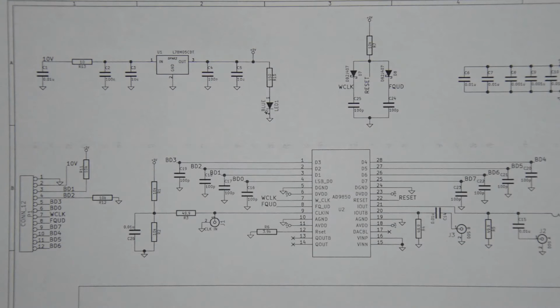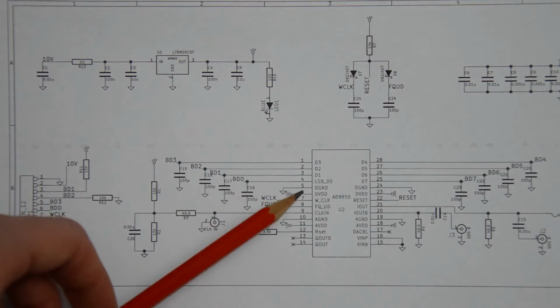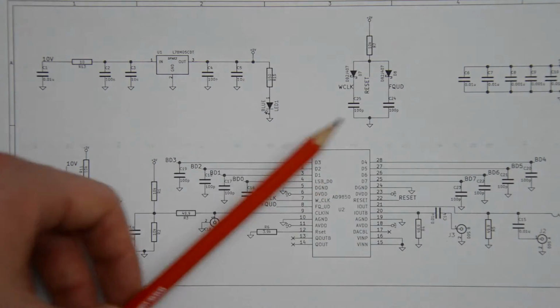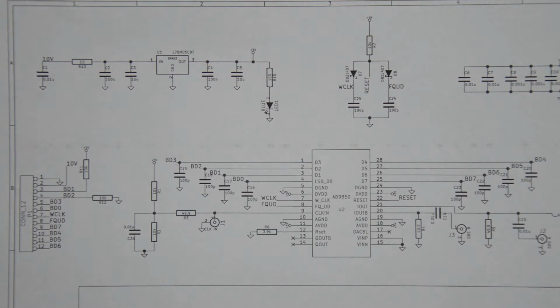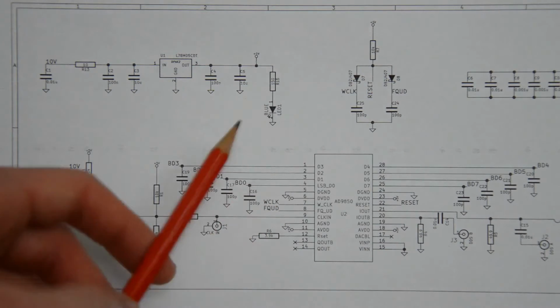In that previous video, which I believe was number 9 in the series, I basically discussed what's inside this main chip. This is the DDS chip, an AD9850 DDS chip from Analog Devices. I did so by discussing and building up internal building blocks of this and putting them together to hack up my own crude DDS. So if you're interested in that, I suggest you go and watch that. But I didn't discuss this chip in particular. Now, the way you use this chip inside is pretty much exactly what I discussed in that video.